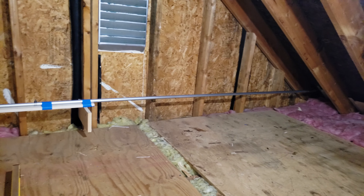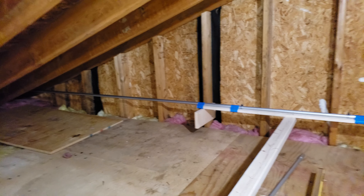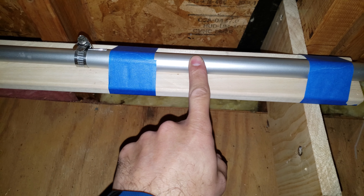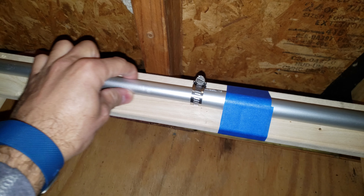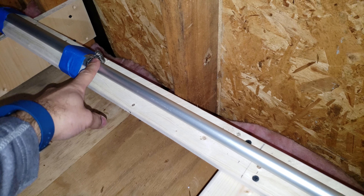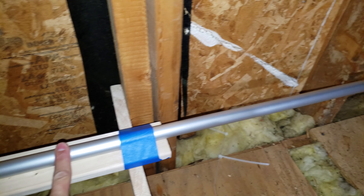Here's the reflector. It's aluminum tubing, a couple of different sizes. I've got an external pipe here — this one is seven-eighths inch in diameter. Then I've got a connection here; this is three-quarters inch in diameter. This pipe is six feet long. The part from here to here is 23 inches, and the two side pieces of pipe are separate pipes, about ninety-four inches apiece.